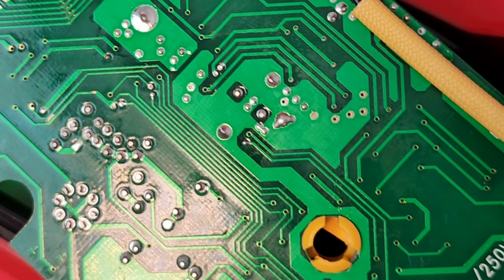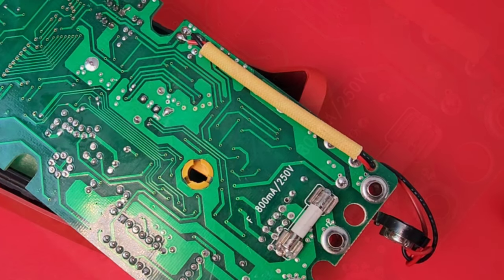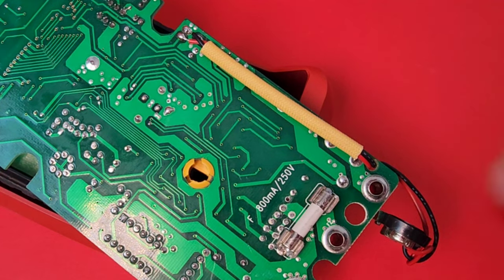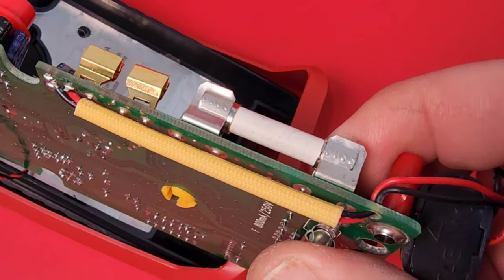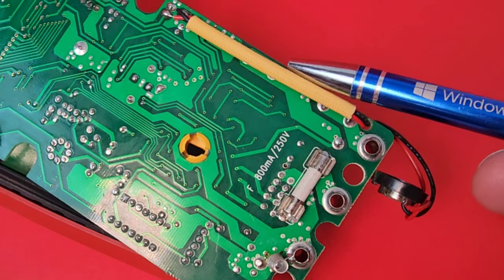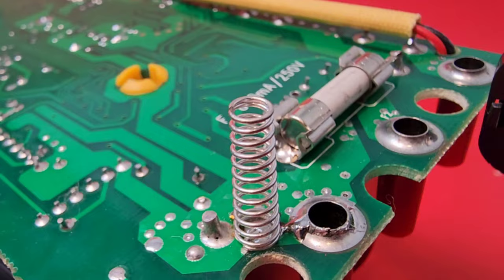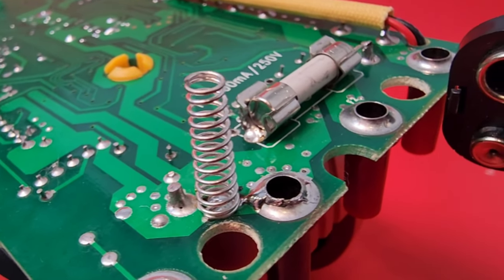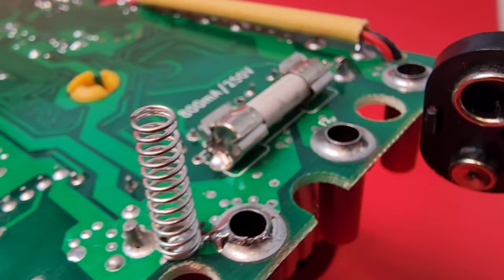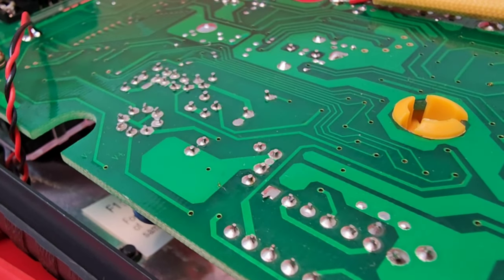All in all, really nice — nothing funky going on here. This is a quality piece of PCB. The insulated housing for the battery is there because it's right underneath the high current fuse, so it could get rather toasty and Metex or Triplet didn't want that to happen. There's that grounding spring as well. Nice soldering all around — beauty.